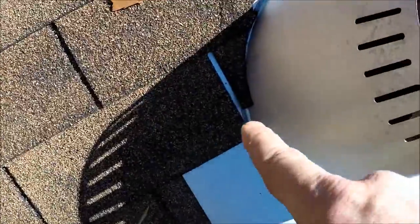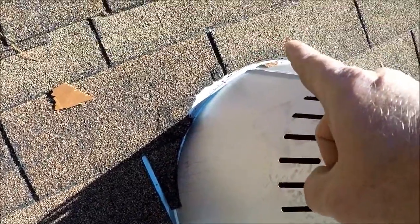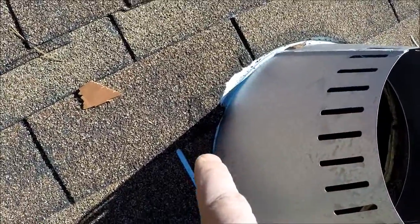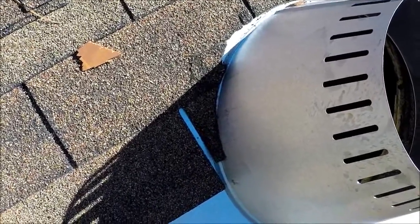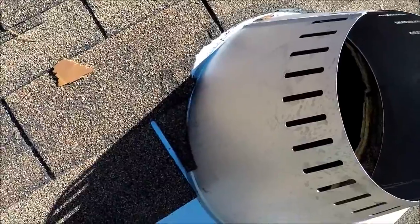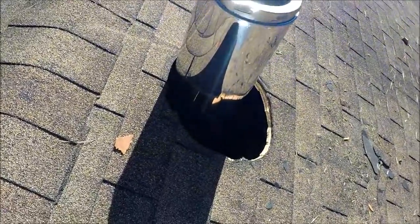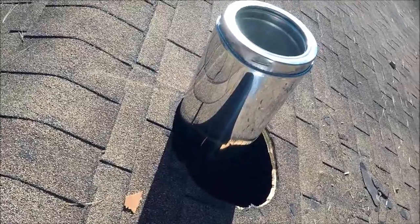What I had to do is pull up the top half of these shingles — the shingles on the top half of the flashing — and get up underneath there. I actually, by hand, used a sawzall blade; it was the easiest to sort of pry them all up, find the nails, pull the nails. Another way I've heard is that you can actually cut the nails with a sawzall blade. Now I'm going to remove this and tar it up and put it in place — I put the chimney pipe on there just to fit it and see how it is. I need to be two inches off that pipe with any combustible material. I've got about a quarter inch there — I need to trim just a tad more to get it safe.